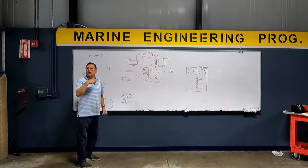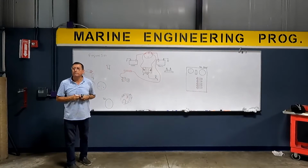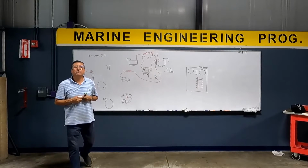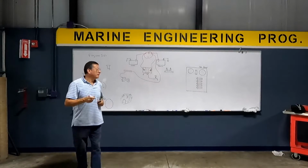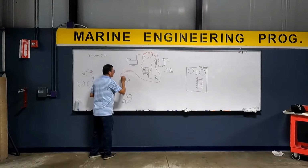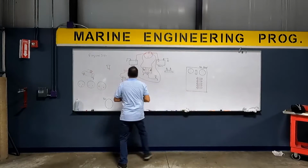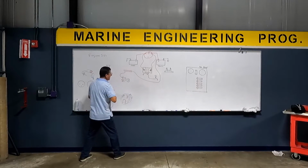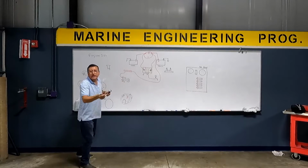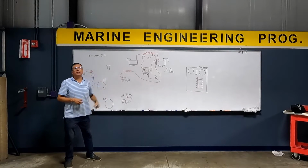In this particular case, we are going to do that example. We are going to connect constant power, and the power enters what terminal? What is the terminal on the ignition switch? Battery. With the letter B. You remember? BIS. What is the other one? With the letter I, for Ignition. And what is the other one? With the letter S, for Start. Start motor or signal. 1, 2, 3. That's okay?